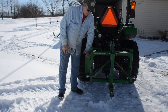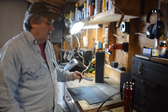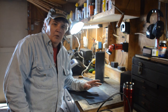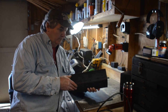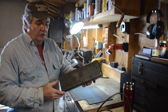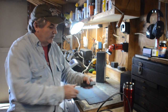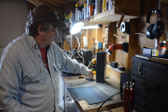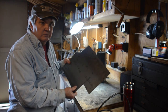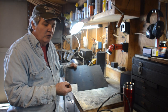I don't have a lid on it right now, but I'm going to make a lid at a later time. Let's go and make one. The material is not really super important — you can use what you want. There's no load-bearing weight going to be on it; it's basically just a container. I've got a four-inch by four-inch thin-wall square tubing, 12 inches long. I've also got some strap material, two inches by five inches, 11 gauge thickness, and some 12 or 14 gauge material for the bottom.